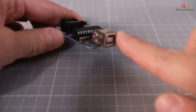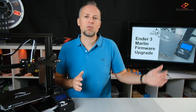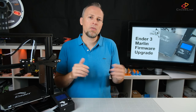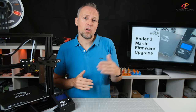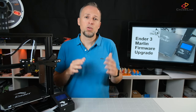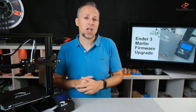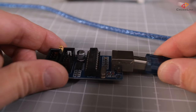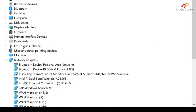The second programmer option is the USB Tiny ISP. It's technically very similar to the USB ASP, but has the advantage that it can be used with a USB cable, giving you more distance from your PC to the printer, which is sometimes more convenient. It's also available on Amazon, but it doesn't come with the 10-to-6-pin adapter by default, which you will need to purchase separately. To install the drivers for the USB Tiny ISP, go to the link in the description which takes you to the Adafruit driver download page. Install the driver software and make sure the USB Tiny ISP option is selected. After this, the USB Tiny ISP should be visible in Device Manager in the LibUSB Win32 Devices section.